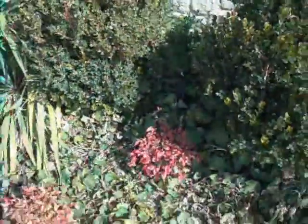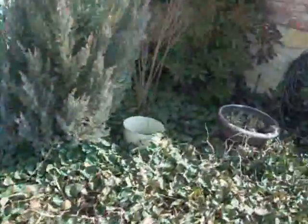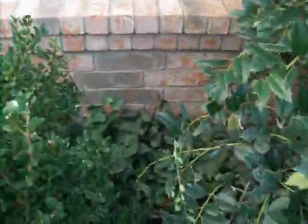Also, when you're inspecting it, the home inspector is going to call it out and say not visible because of vegetation. So you want to cut this back and remove it completely. It's very simple. Cut back these bushes here, so you've got about a 10-inch space, and cut back the plant here, so you've got a lot of space between the plant and the actual house itself. And do that likewise in this corner here. In fact, I would recommend that these trees and bushes here are taken out, because they remove moisture from the soils and it can cause damage to the foundation because the foundation moves.